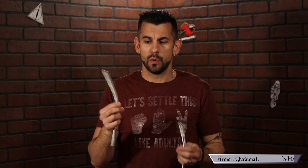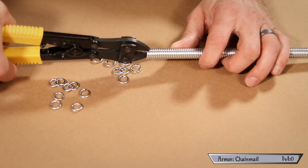Once done, clip the ends of your coil free and slide it out of the jig. At this point you've basically made springs — I actually find that really cool. Now, using wire snips, simply cut the rings free from the coil. This is by far the most energy-consuming part of the build. It doesn't take long, but it is a major hand and forearm workout.